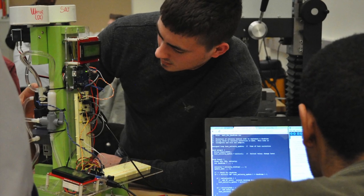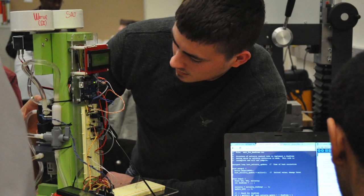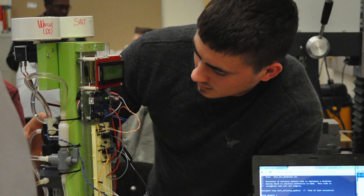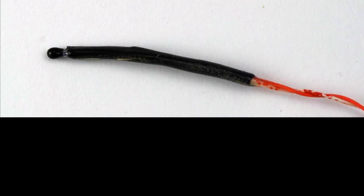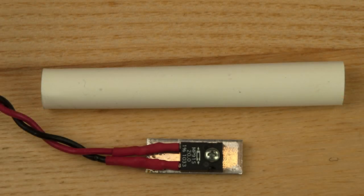By midterm, you'll have a system that measures the salinity of the water circulating through the flow loop. Your system has an LCD display to show the salinity readings. You'll also write an Arduino program to keep the salinity within prescribed limits by controlling two solenoid valves — one connected to a supply of fresh water and the other connected to a supply of salty water. The next step is to add temperature control. You'll make a temperature sensor with a thermistor and calibrate it against a digital thermometer. You'll build a heater from a power resistor and a heat spreader. The temperature sensor readings are input to an Arduino program that you write.